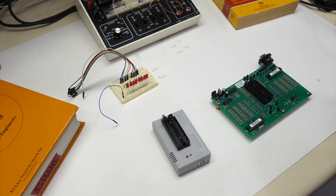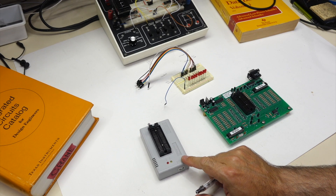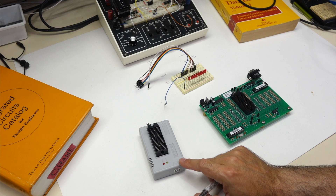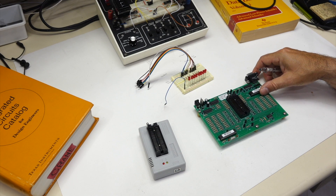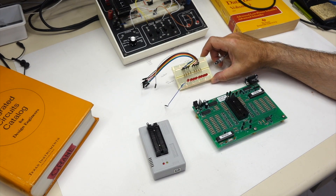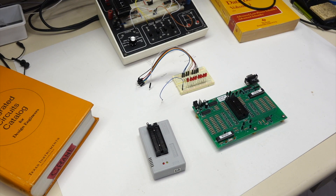You might wonder which one I recommend after this test, and the answer is both of them. If you need only one, the TL866 is a fantastic device — professionally made, very cheap, you get a ton of adapters. It tests TTL, but that's its side job; it's a great programmer and reader of EEPROM, and for the price, can't be beat. And if you want more detail on your TTL and want to catch the marginal ones, the Tauntek, as you've seen, is very, very good — I'm going to keep it and use it a lot. And of course, in case neither of those work, never underestimate the power of the breadboard. You can always test TTL chips on a breadboard. All right, see you in the next episode!